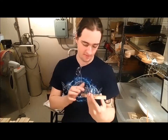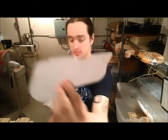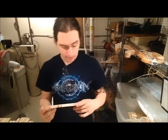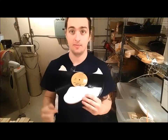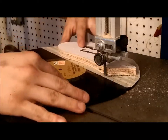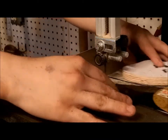It's got a little bit of overhang here, which I kind of like because it allows me to sand down the final product. I also went ahead with the drill press and put the holes in there corresponding to the holes to mount it on the guitar. So the next step is to mount this template on the vinyl wherever I want — I am going to use double-sided tape — and then I will roughly cut that out with a bandsaw, and then use a bearing bit on a router to trim it up. I have gone ahead and attached the plywood template to our laminated vinyl using double-stick tape.